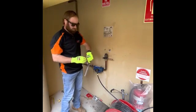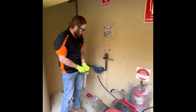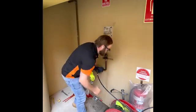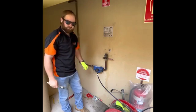I'm going to set a stopwatch for five minutes. After five minutes, I'll open that valve — just crack it — to ensure that the freeze has taken place. And then we'll go ahead and change that valve.